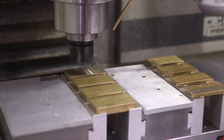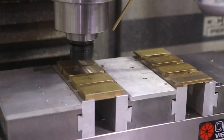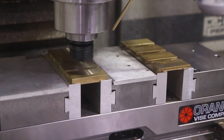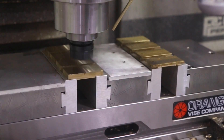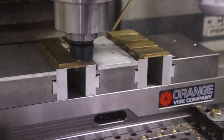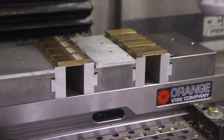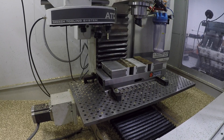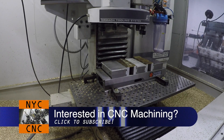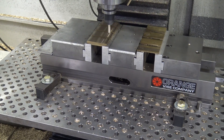So if you notice, we've got some aluminum plates laying over the orange vice. The backstory there is somebody — not to name any names — I was repairing an airline behind the mill, and when I took a panel off, I ripped out one of the feed wires to the ATC. It was giving me an error, and I was like, I wonder what's wrong, thinking it was going to be a big deal. I popped that cover off and sure enough it was just a loose wire that I stuck back into a screw terminal. But I'm protective of this new orange vice, so I thought I'll just drop a couple pieces of aluminum on it in case it accidentally drops a tool. We've been running probably two or three hundred tool changes in the last couple of days and it's been fine. It took us a while to get this thing dialed in, but it's been pretty solid since then.